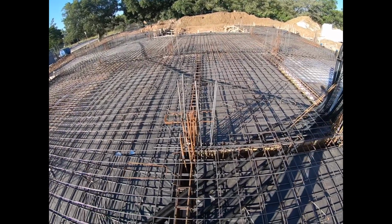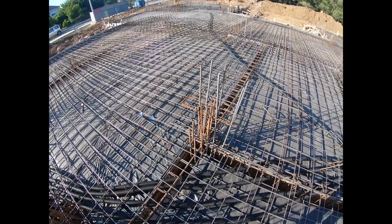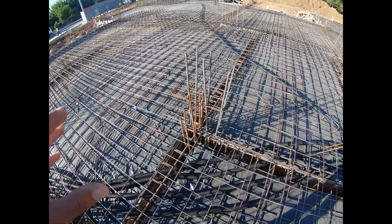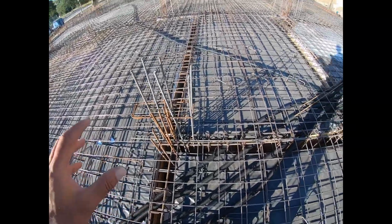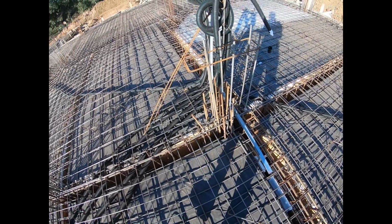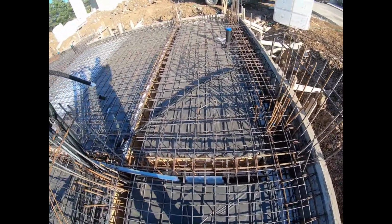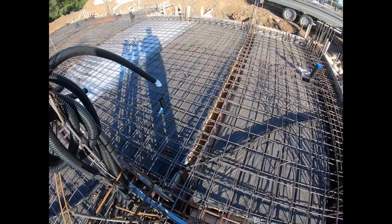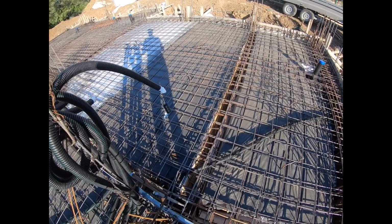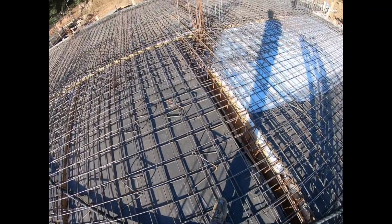And what the engineer does is he creates a plan where you essentially have these basically lying down concrete beams, so the whole entire house is almost floating, and all the load, all the weight is focused right on where they drilled those holes. So we're not lying flat on the ground, we're essentially standing on those beams. And you can see one here, and all throughout the house. And you can see wherever you see these lines crossing is where the concrete is going to sit, and those are our beams. And these beams run directly onto the piles that we drill into the ground.